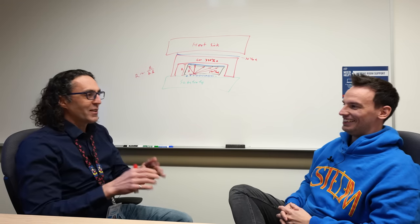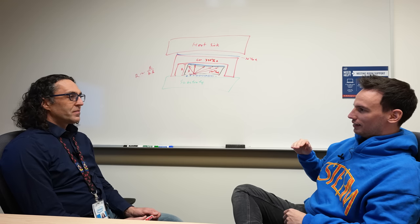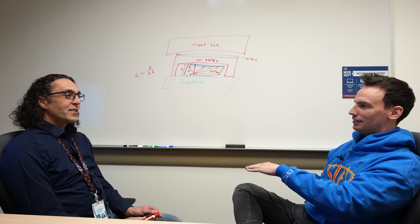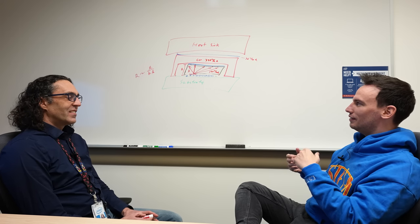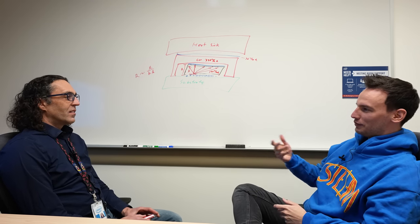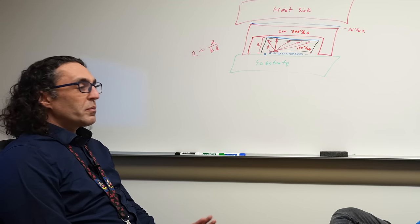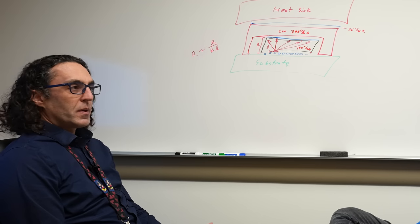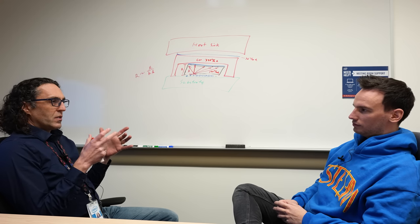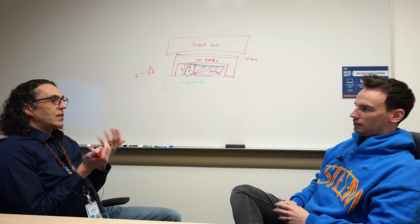After grinding it down, after thinning, we are left with just bare silicon. And people are mostly using liquid metal on this, which is gallium — and gallium loves to diffuse into metals. Do you have any insight on whether there's a direct risk doing that? I'm not aware of any issue on silicon. We've played around with it a bit on our mobile parts, experimenting in the lab. The experiments we've run have been at our normal mobile die thicknesses, which are somewhere around 200 microns plus or minus. As far as I know, we haven't seen any problems with the silicon itself.